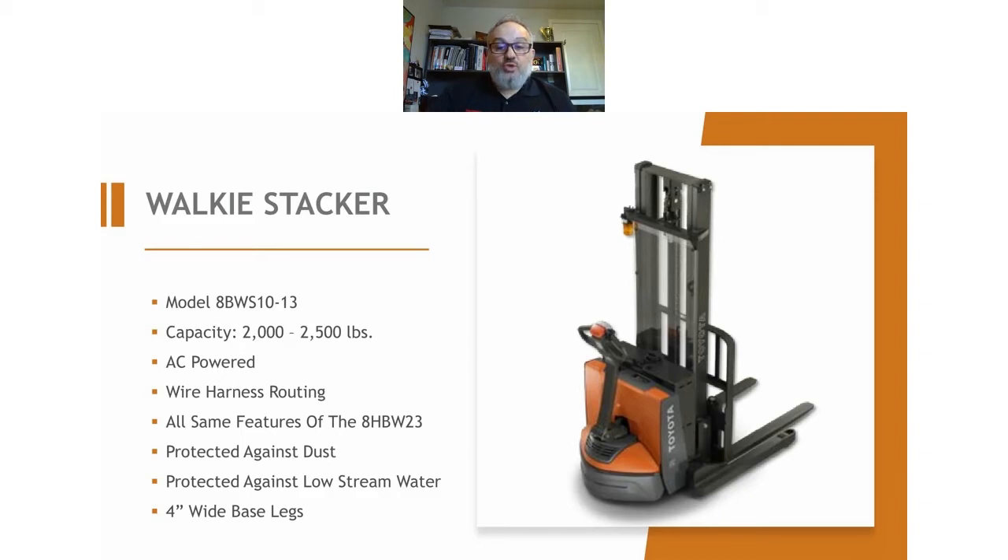The straddle legs are 4 inches wide, so this model does not reach out. You have to accommodate the machine by leaving 5-inch gaps between your skids. You can't block stack — you can't put the skids up against each other or this machine will not work for you. Depending on how your warehouse is set up or whether you're willing to adjust your layout, this machine may or may not be for you. If you've got 8-foot beams, this is not a machine for you because you're not going to have room to leave space between your pallets. You've got to have at least 9-foot beams, or no racking at all where you can control where you're placing those pallets.